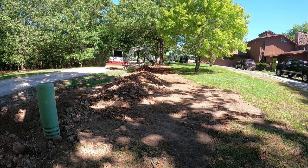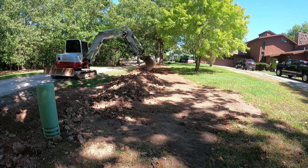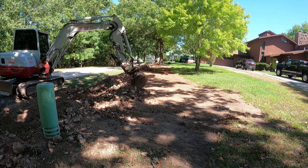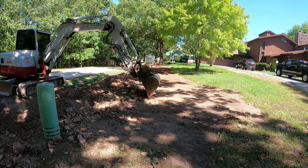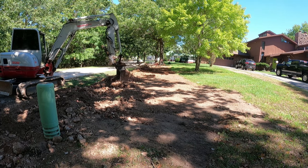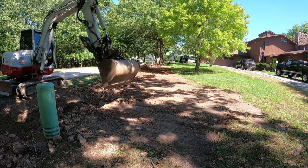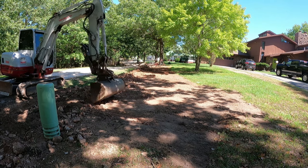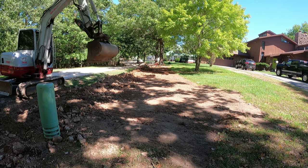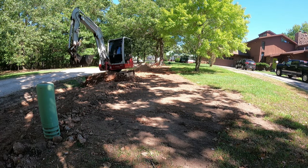The remainder of the clips I've got is just backfilling these ditches, trying to get them cleaned up out of these people's yards, and spreading them out there with the loader. Probably the following day, we'll try to get some topsoil and put it on here. Then I'll have to bring the straw blower out and seed and blow straw on them. Then the water company will come out and do all the hookups, because where the main stopped, there was a flusher valve with a concrete block on the end of it that they wanted to dig up and see what was around there. I'm going to be there so I can figure out on the next one what needs to be done, and then they will also set the meter and hook the meter up to the house line.